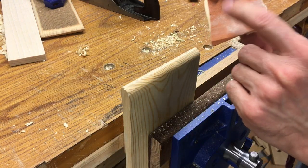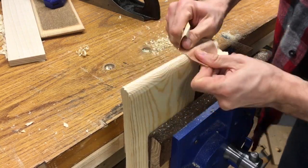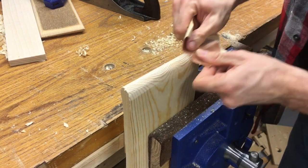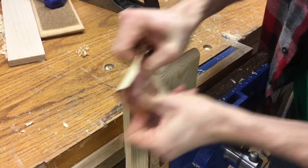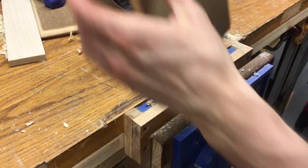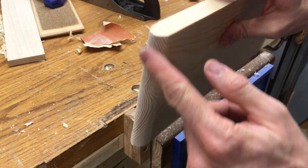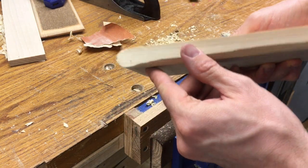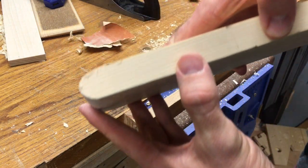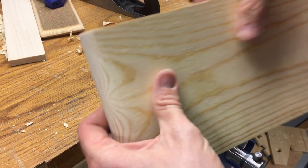After that, I'm going to take 120 grit sandpaper and just rub it over like this. This is super smooth — it is so nice. It is a really accurate method to make this roundover. You can see that's pretty even, so I'm happy with that. Let's go ahead and go to the long edge now.